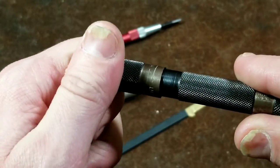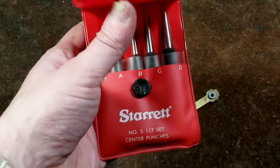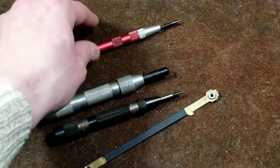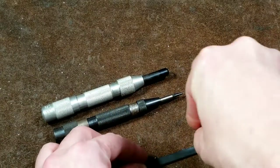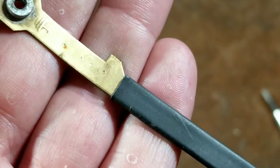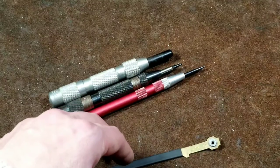That's kind of why I don't use these as often — I use them occasionally for marking. But when you really need a nice deep divot, you really do need to use standard center punches that you can hit with a hammer to make a nice deep divot. And while we're at it, this one's actually nice and sharp. We'll go ahead and use this compact version. We'll just show how that works — it gives you a nice little dot.